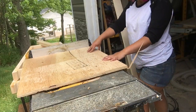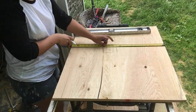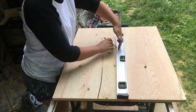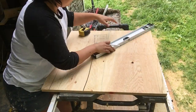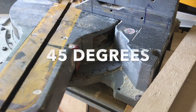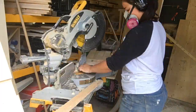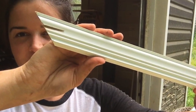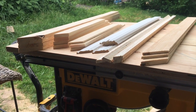Your first step is to cut your plywood into a square or a rectangle, or whatever space you're trying to fill, and then find the center of it. Go ahead and set your saw to 45 degrees. Take all of your scraps and cut just the slightest bit off the end so that they are all 45 degrees, and then we'll get to putting them on.